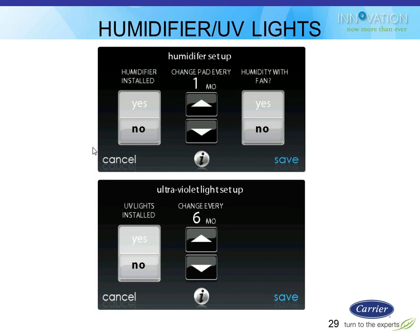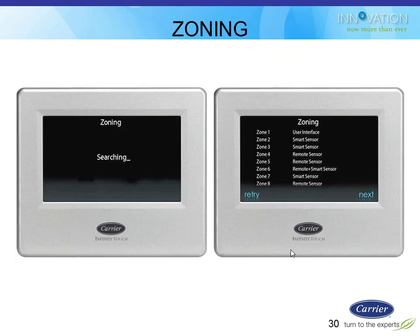And then to answer Dominic's question, if you had an RGF air purifying light or an APCO triatomic light, you would just use the same UV light alarm on here and change and set it for that. Instead of saying change it every year like you might on a UV light, an RGF I think is every 3 years, and that kind of thing.